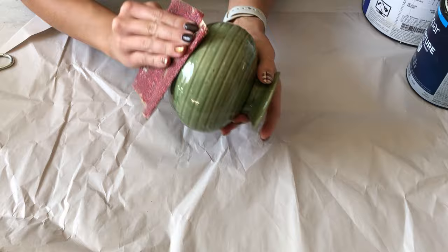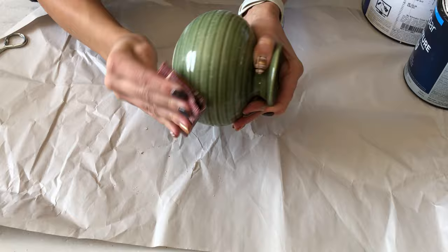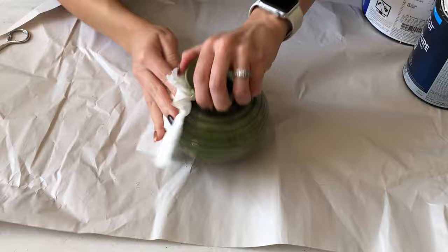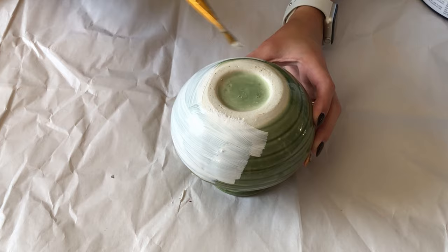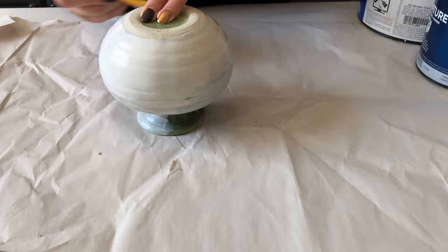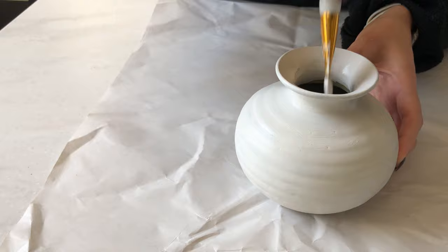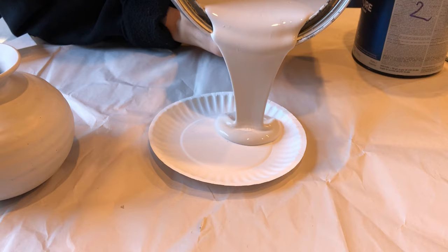Because the surface is very glossy and we're going to be painting it, I'm giving it a light scuff sand because having a bit of texture on the surface really helps the paint stick. Now I'm wiping it clean to eliminate any dust or grit from the sandpaper. Now we're going to go in with our first layer of paint, which is technically going to act as our primer, so I'm using some leftover Popular Gray by Sherwin-Williams and giving it a coat all over. I ended up giving it two coats overall.